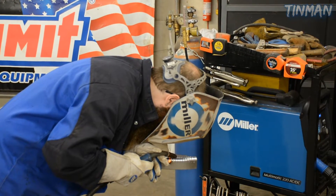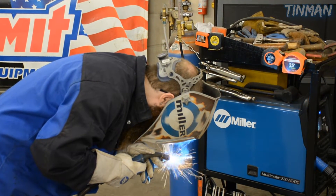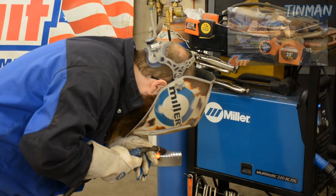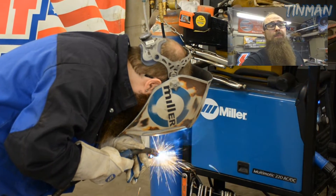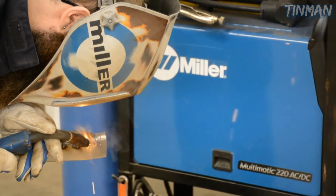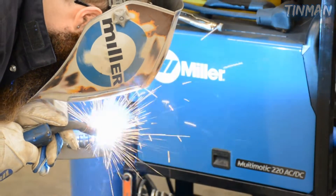Now there's also some shapes of material that will shrink more or less depending on the size, if there's any bracing on that material anywhere, and things like that. Now shrinking from the weld is something that you really can't stop. You can control it in a way that limits it, you can plan for it, or you can fix it afterwards.